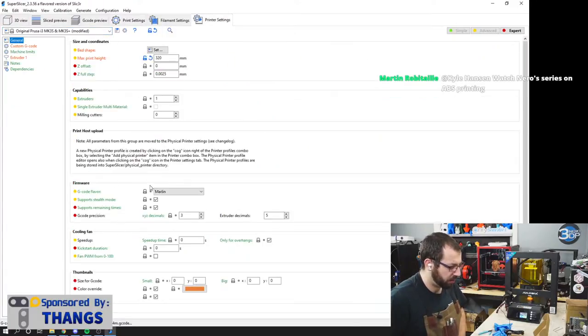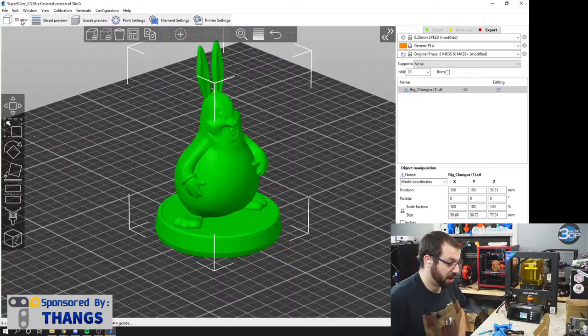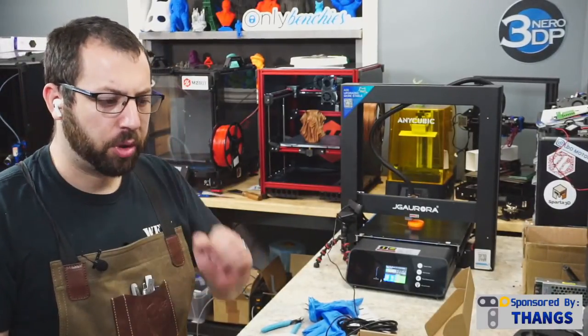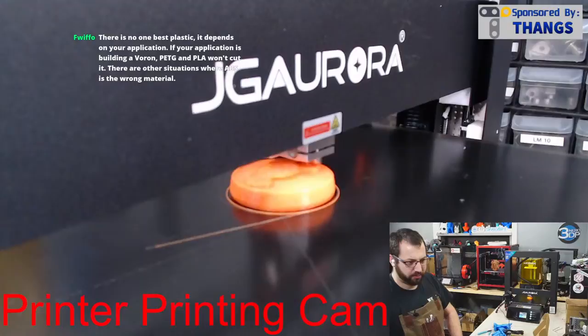Yeah, what's my extruder running at? Retraction speed is, it doesn't say. 35 millimeters a second. So yeah, you know what though? It's honestly probably the firmware accelerations and max speed are pretty low. I really don't have control of that because it's not Klipper. I just can't go in there and quickly change it.